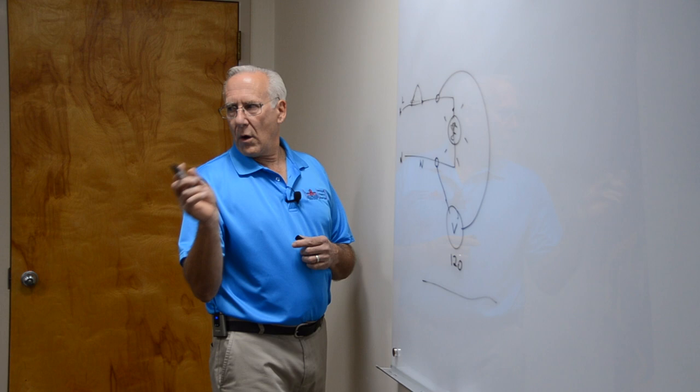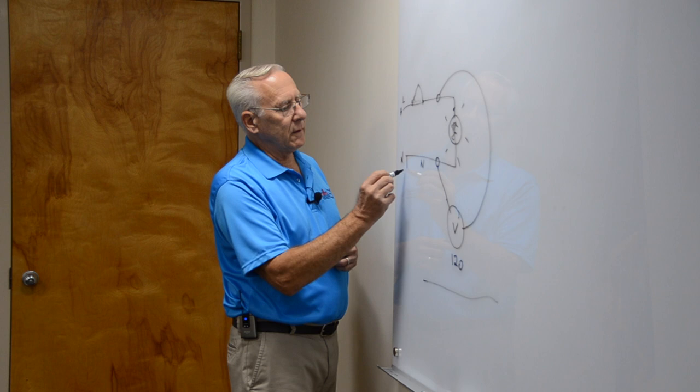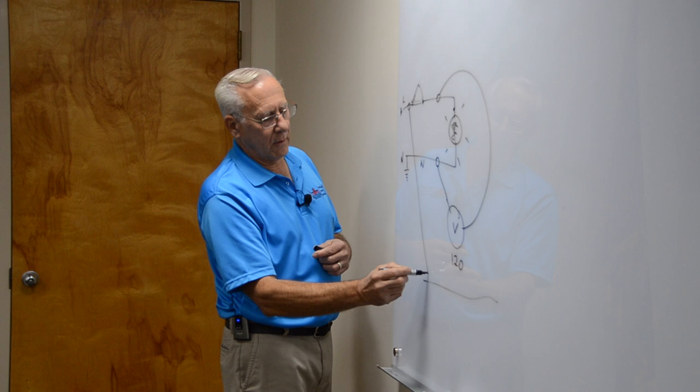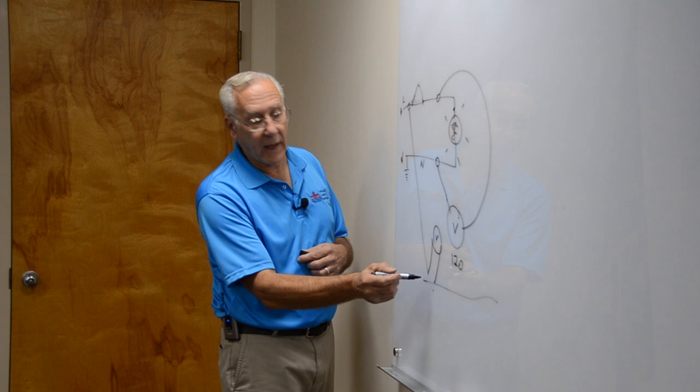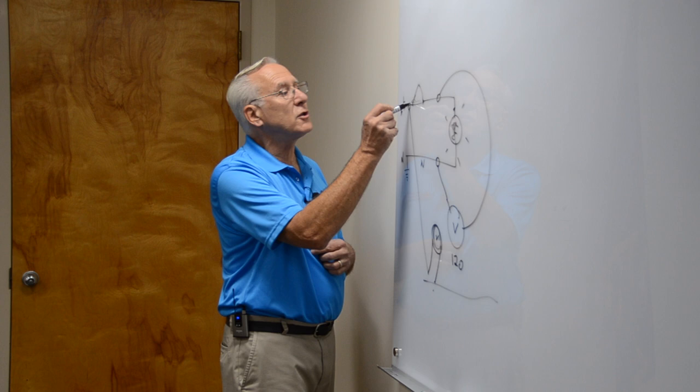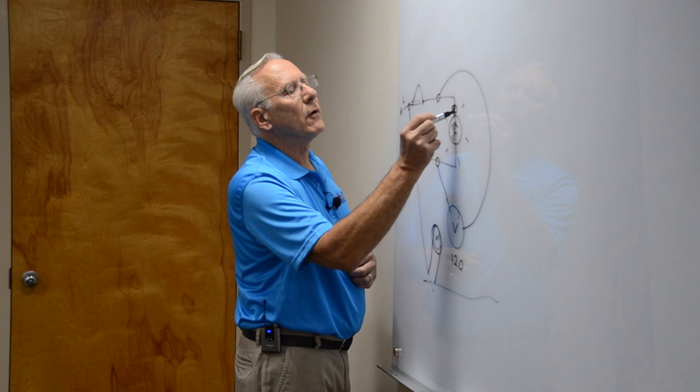We already know, because the neutral in your panel is grounded, if we take the voltmeter from here to the ground, we're going to get 120 volts, right? Hot to ground, we're going to get 120 volts. I'm going to show that to you, but we're going to get it, trust me. So if you touch this and you're standing on the ground, you're going to get 120 volts. So if you want to touch this wire, you want to put your voltmeter here and test it to ground.